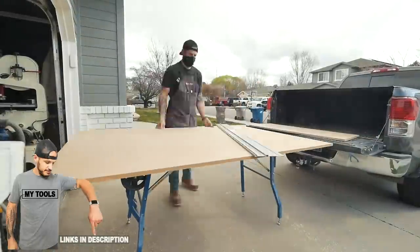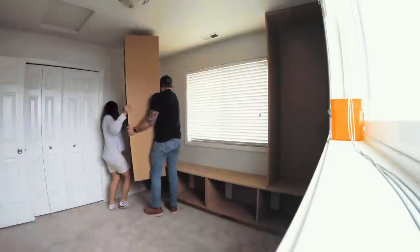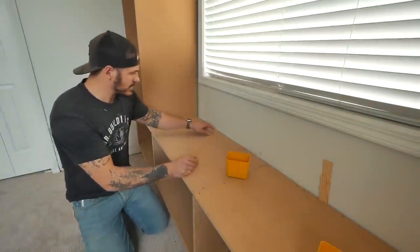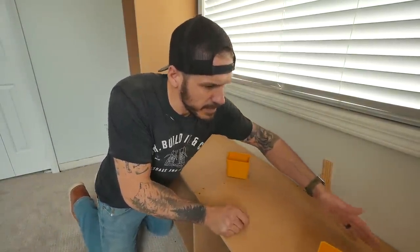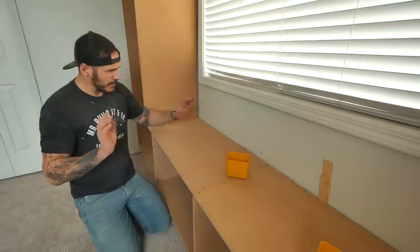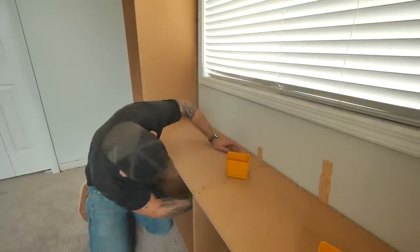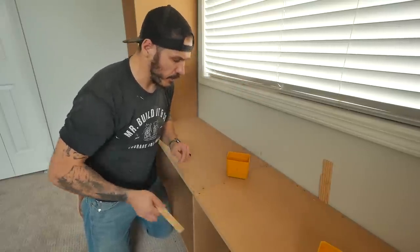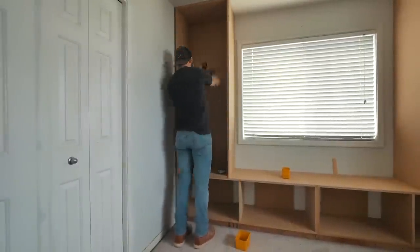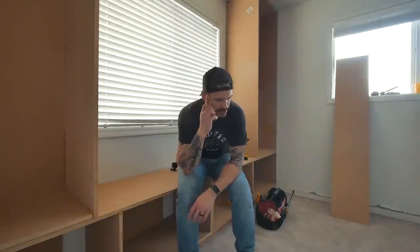I built the upright vertical cabinets for the shelves the same depth as the base, which is 18 inches deep. As with any home improvement project, walls are never perfectly straight, so when securing everything be sure to use a level and some wood wedges to level all the cabinets during installation. Some places will have gaps — you could cut through and push it in, or use shims. Shims are typically what they do with cabinets so they're not tinkering with drywall. Put the shim over the stud and screw from the side — very cheap at hardware stores.